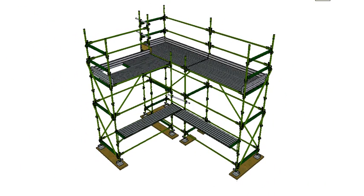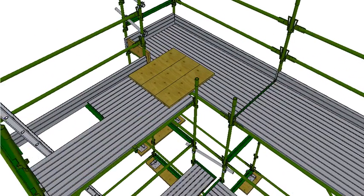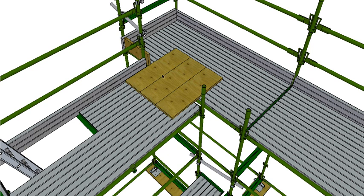And that's all the main components of the scaffold. Obviously we need our ladder in, and it needs to be tied top and bottom so it's not going to slip. If you have a large gap to bridge, you can use timber planks on metal planks — you can't use metal on metal, so you need timber planks across to give you a safe passage.